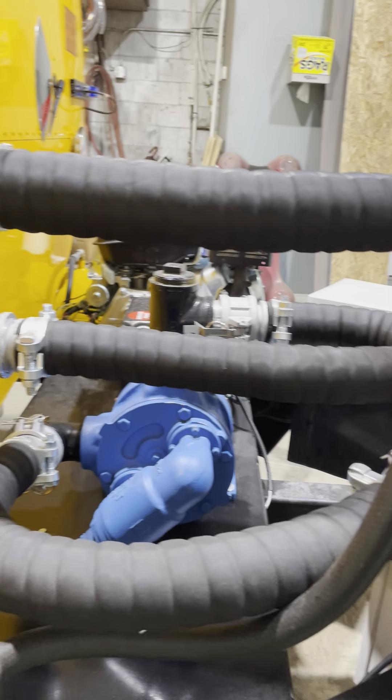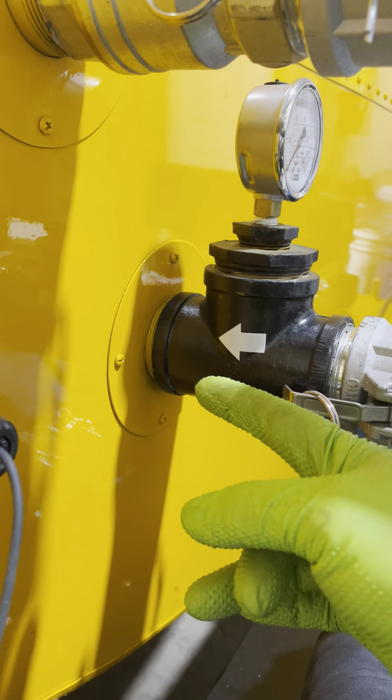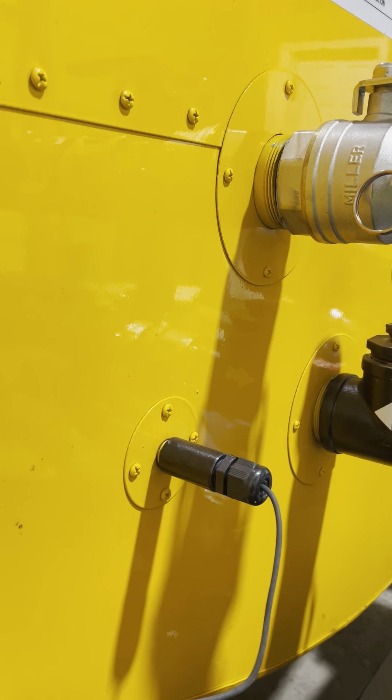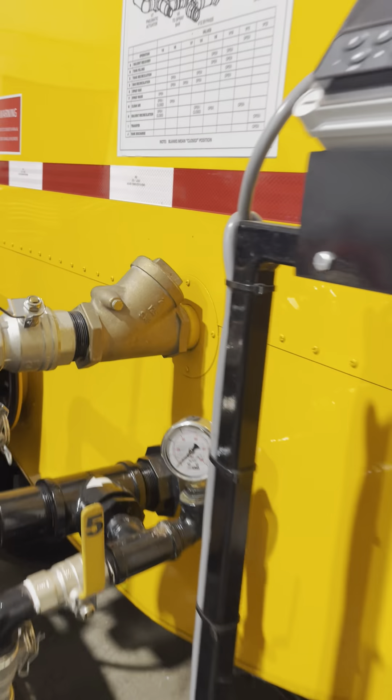Material goes directly down, passing through open valve four, following the line into the pump, coming up out of the pump, around the turn, following the direction of material flow past the pressure gauge, passing through the pipe that goes through the main tank, and coming into the rear manifold.